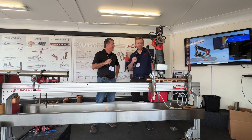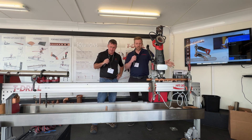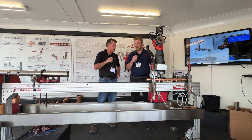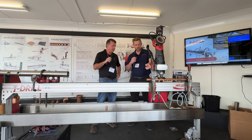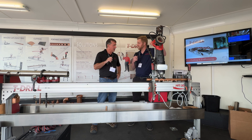This is our T65 stainless steel unit mounted here to what we call our HFT table — or hand feed table. What we're doing here is creating a manifold. The cool part is we're eliminating two of the three brazed joints, pulling only one outlet instead of taking a T-fitting and inserting tubes on each side. We're building right off the existing line — super easy.